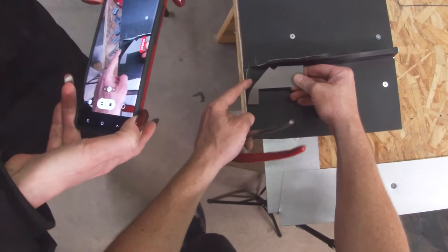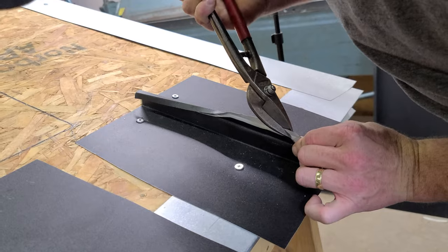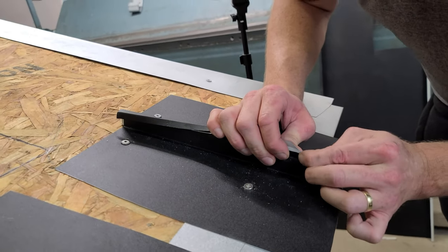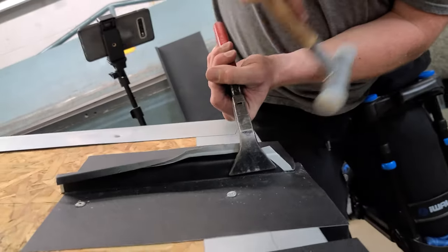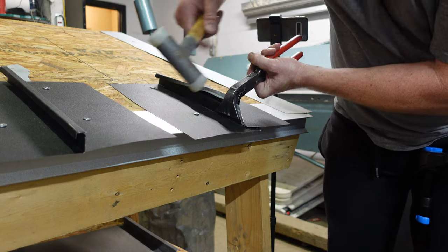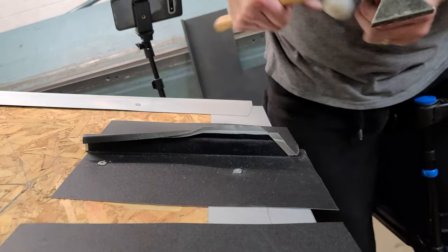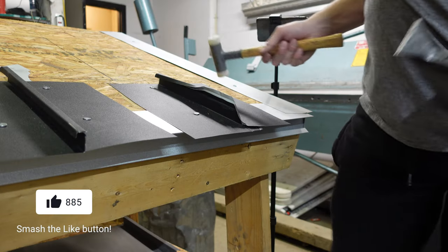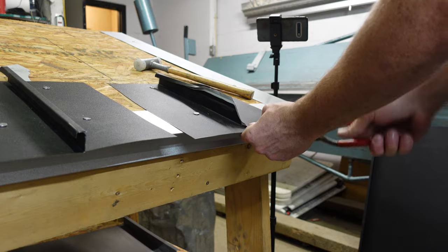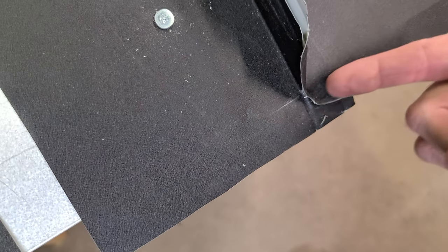You can see if we were to bend this flat — there's that — and it turns into the seam here. That's why I had to bend it 90 degrees, because it represents the seam. Forgot to notch one thing — the corner of that meets, that's where the edge of the notch is. We're going to start by folding this edge around, and what the folders do is give a nice edge for that metal to bend around. If I didn't use them, this would just kind of curl over on itself. We get a nice crisp bend line, and as we're forming it down we're bringing this side down too. You can see right here the reason why it gets thin here in this part of the jig is so this can stretch.